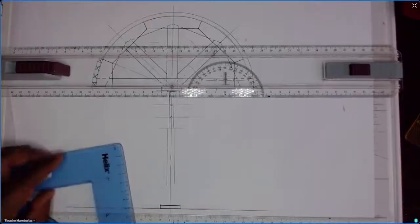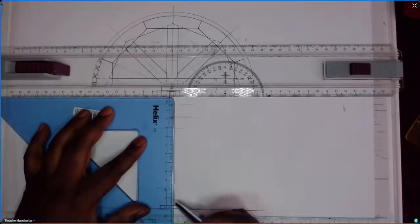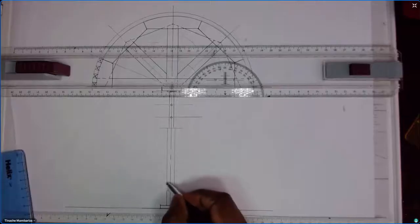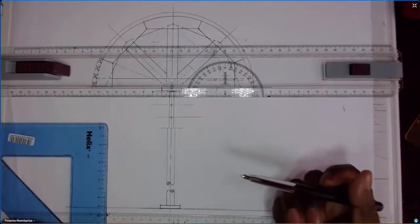Right, then all you do is just draw a small portion of the pipe strut. Then what you do is you then put a break. So this is how you put a break for a pipe or a shaft. Then on the opposite end, this one is going to be like this, and it comes and loops around. And because it's a pipe, we have to show the thickness. Right, so that's the break for the two.